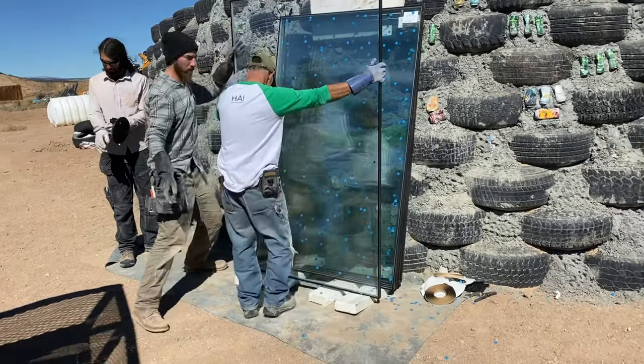Okay, so what's gonna happen from what I can see is I have a choice now to be made. What I can do right now is I can see that the window's doing this. So I have an 1/8-inch setting block. I could ask Matthew to lift and slide it off, but I'm gonna go ahead and roll the dice. Okay, guys, you hold it. Matthew, you need to give me a tilt. You gotta bring it back out, and then lift just a little more. Okay, then let it down. Okay, hold steady 1 second, don't move.